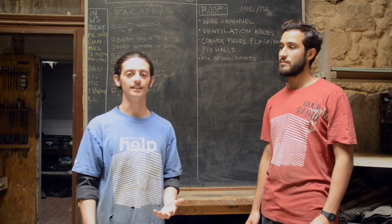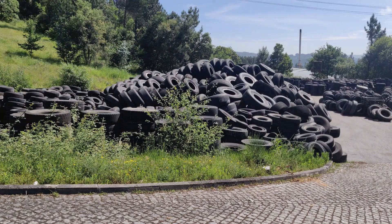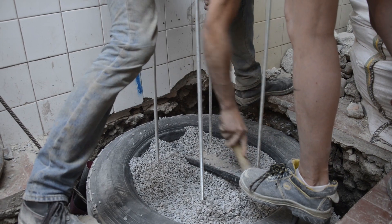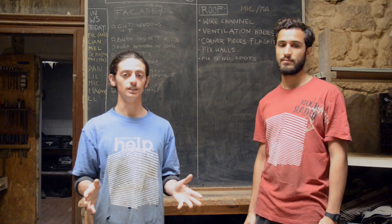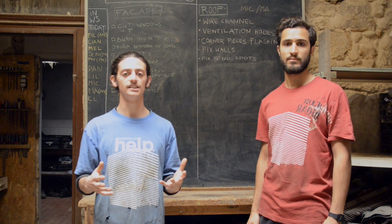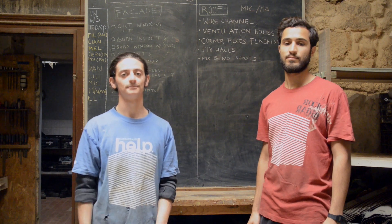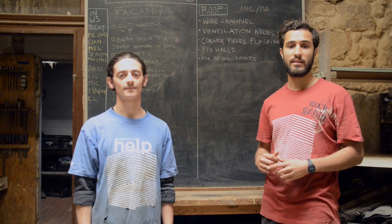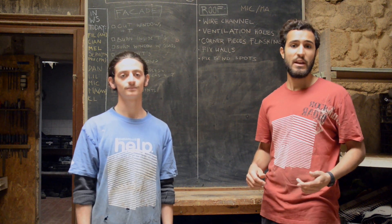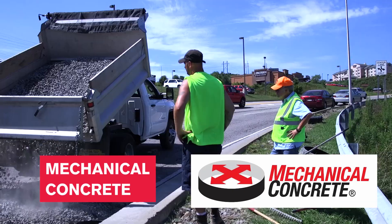Tire foundations, on the other hand, are a low-tech solution composed only of scrap tires filled with compressed gravel and earth. Both components are easily accessible all over the world. The tires get filled and the earth compressed, by which a stress-resistant and highly durable foundation unit is created. Various cases have already been tested and are being used in the construction field all over the world — for example, making road beds of streets, where they are referred to as mechanical concrete.